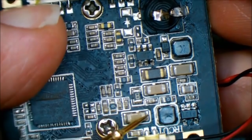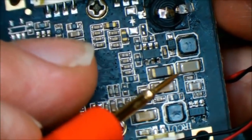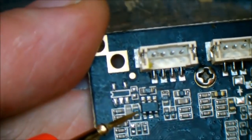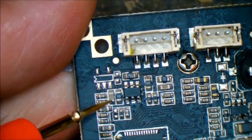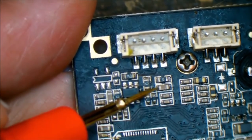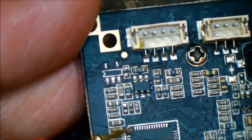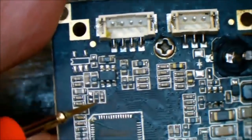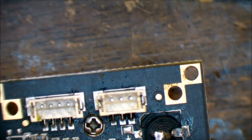2k — I thought it was going to be a short, never mind. So far these are obviously our output capacitors. Here's another regulator over here — let's see what that one is. That's 20,000 ohms, and that one's possibly a linear regulator or something totally different with glue. Yeah, okay, it's looking good. Let's replace that capacitor and put some proper voltage on it and see what happens.